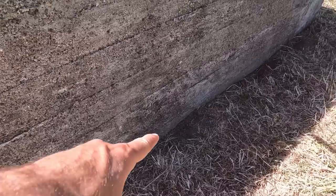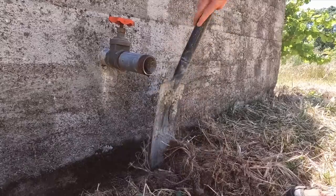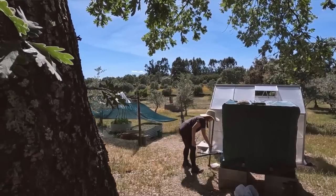While Victoria is just finishing off the pressure washing, I'm going to dig all the dirt immediately around the tank and around the foundation, right down, so when we come to paint we can get as low as possible — just below ground level. We are done on the tank for now. The next step was to paint the metal, but on the paint can it says don't paint in direct sunlight and don't do it when it's over 25 degrees, and it's currently about three o'clock in the afternoon — so it seems foolish to make a pig's ear of it. We're going to come back out later this evening once it's a bit cooler, maybe after we've walked the dogs.